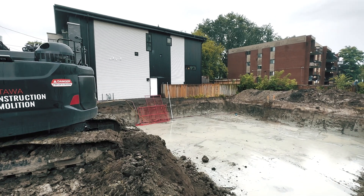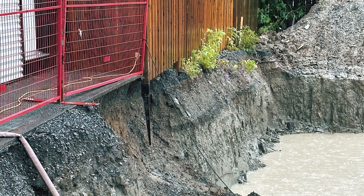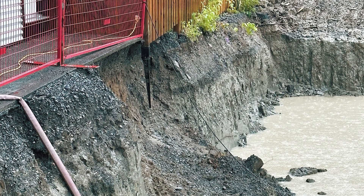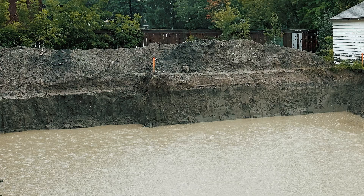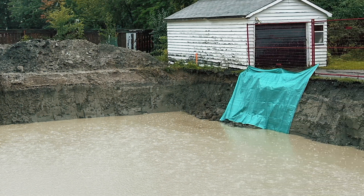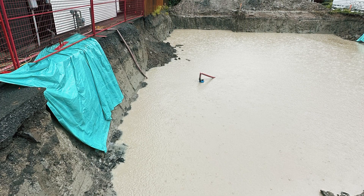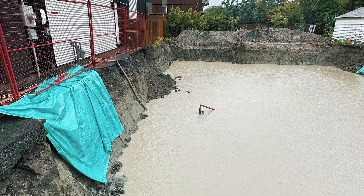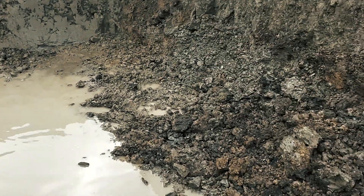In rainy conditions, I had a few pumps running at all times but we were collecting a lot of water at the bottom of the pit. Another major issue caused by the rain was that the excavation walls started to collapse in some places where newer builds had been backfilled with sand, making those walls less stable. We had a monsoon rain a few days before the footing was supposed to go in and some of the excavation collapsed — yards and yards of dirt needed to move in, and since the area was already excavated we couldn't get any machinery in, so it was all done by wheelbarrow.